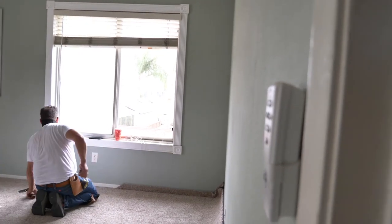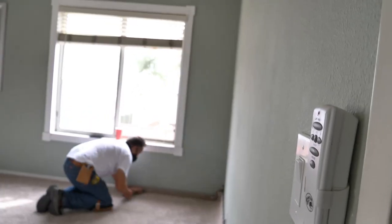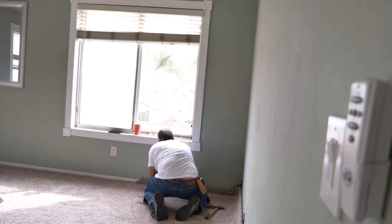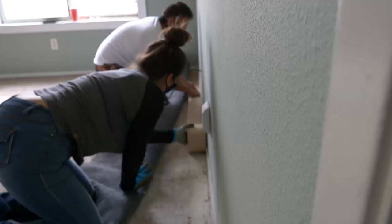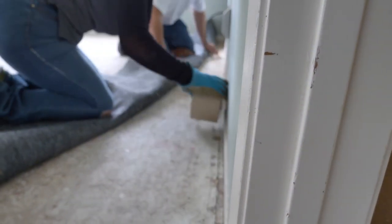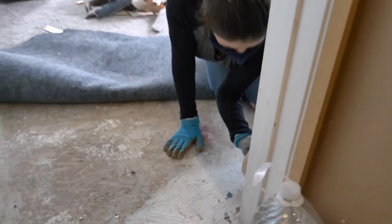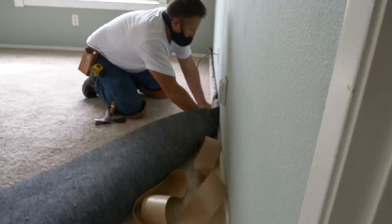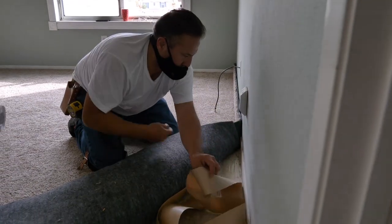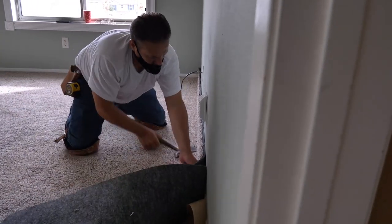This part calls for a very clean, if not spotless, subfloor. That's why they were working so hard to make sure to not only get up the nail strip and all the nails, but all the dust as well. So if you're going to do this, make sure you vacuum every aspect of the corners especially, because tape doesn't stick that well to dust.